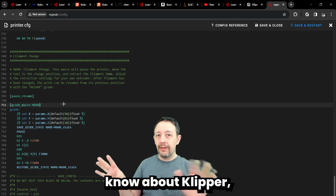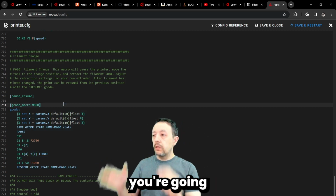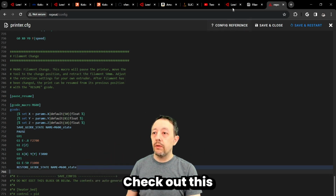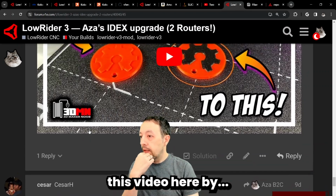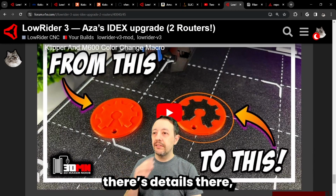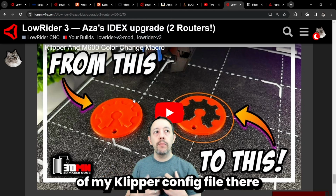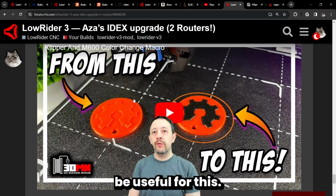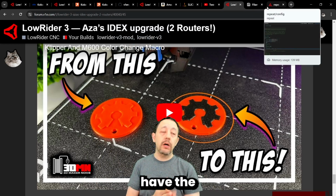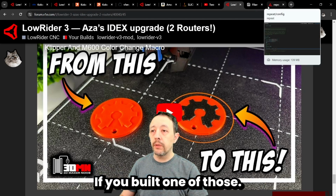For anyone that doesn't know about Klipper, this will not make any sense, but for you Klipper people, you're going to need to update your configuration file to have a macro. Check out this video here by this person, and there are these details there. Or again, you can go to my GitHub repo, and there's a snapshot of my Klipper config file there, which might be useful for this and also other things that you might be getting up to, especially if you also, like me, have the V1 Engineering Repeat printer, if you've built one of those.